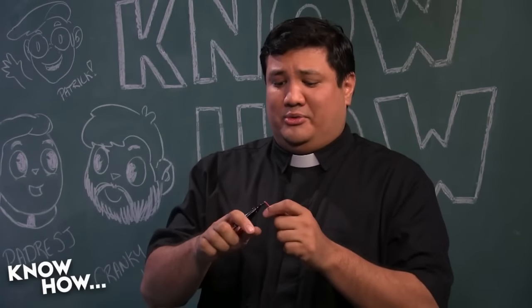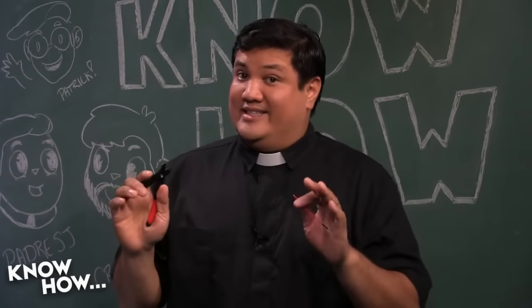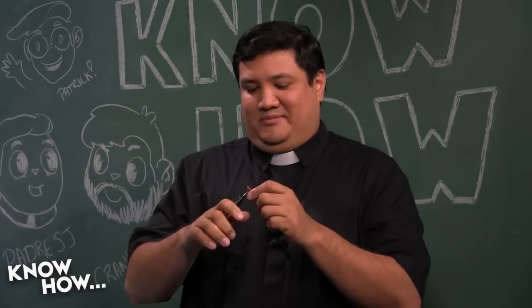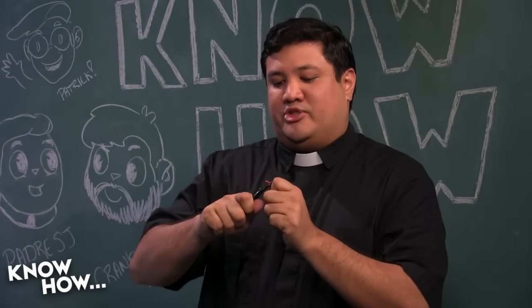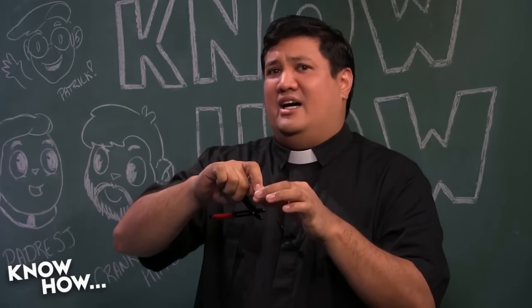By the way, folks, if you're going to be doing a lot of this, get yourself some nice tools. People have been sending me videos of them stripping wires with scissors. Oh, no, no, no. It works. But, no, don't do it. Because what you'll end up doing is striking the copper conductors, and you'll tear a few of them away. It's just no.